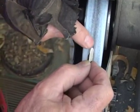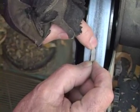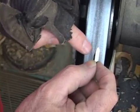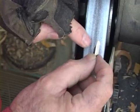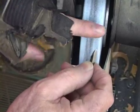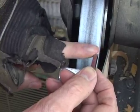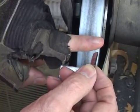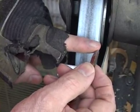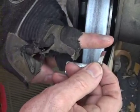What I'm looking for is that the sparks are going to come up over the top, and I can see them right on the sharp edge. If the sparks are going down underneath, then it's not sharp yet and I have to change the angle to get that bevel right directly against the surface of the grinding wheel so it keeps a straight line. When we come to the grinder in this hand-held situation, we're not thinking about grinding the tool — we're thinking about dressing the bevel very lightly, and then the edge is going to get sharp.